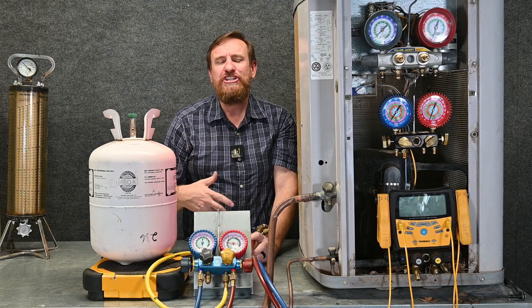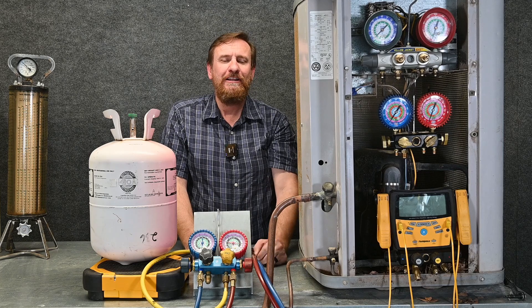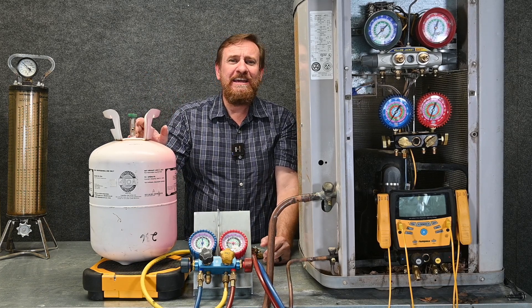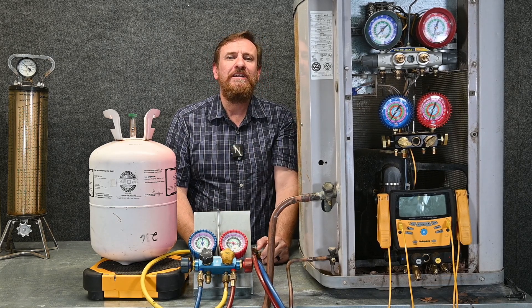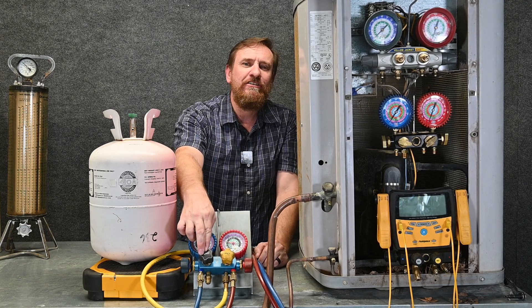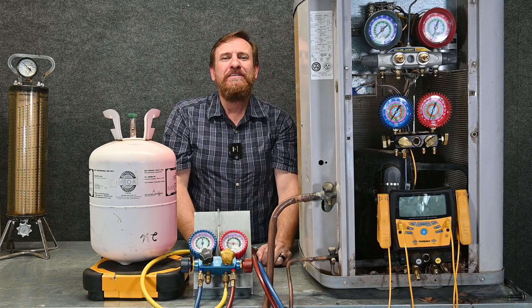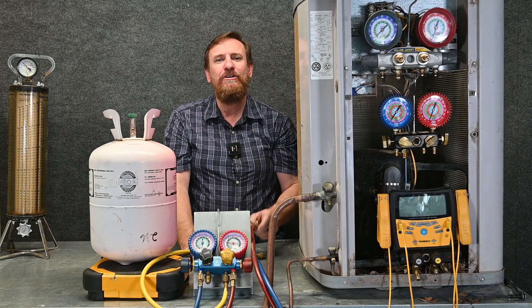It's a little bit more complex, but really it's not — it just gives you more options and more methods. Every service tech has their own methods that they prefer. Learn from somebody, but you'll eventually develop your own groove. It simply comes down to: take it out as a liquid so there's no fractionation, purge the air and moisture out of your hoses so there's no contamination, and throttle it into the unit so there's no liquid refrigerant getting to the compressor. There are many different brands of four-port manifold gauge sets — sight glasses, non-sight glasses, various hoses — but they all work the same way. This fourth port is for a vacuum hose with its own separate valve; we left that closed the whole time and will cover it in a later video when we get to vacuums. That's how we charge with the four-port manifold and manual low-loss fittings.